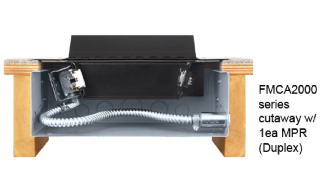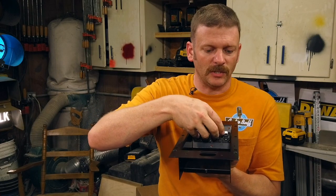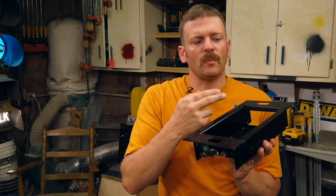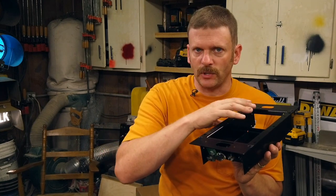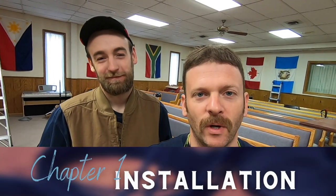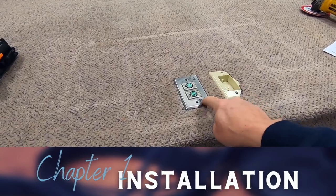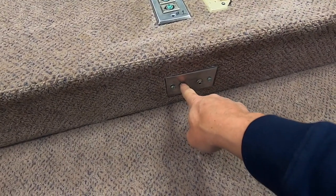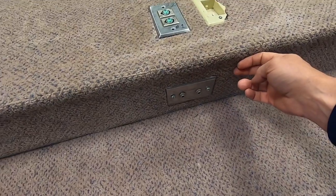Those Moduline insert panels sit at an angle below grade in your floor box. This is an awesome way to take all of your low-voltage communications and put them below grade where they're going to be a lot safer. They also make options where you can have high-voltage in here as well. The best way to show you how this system works is to show you how I install it. I'm Jude, this is Jared. We're in Halstead, Kansas. Today we're going to install a floor box by Mystery — two mic jacks, high-voltage power, and a monitor jack sitting below in the rise of the step.